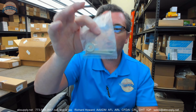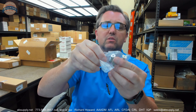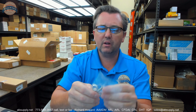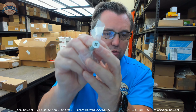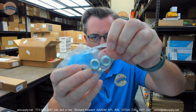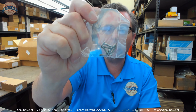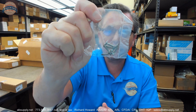It is the same thickness as a standard caliber kick plate from Hager. This is just a simple through-bolt mount. It will have a couple of 1/4-20 flat undercut head screws with a Phillips drive and a couple of finish or countersunk washers. There are indeed two of them in that package. You will also have some number 6 by 5/8-inch oval head sheet metal screws, undercut head as well.